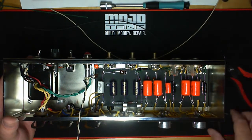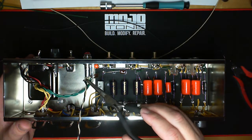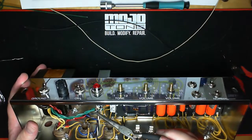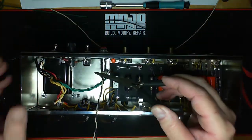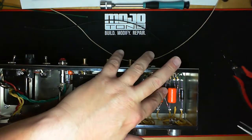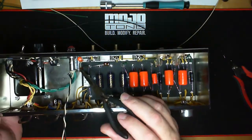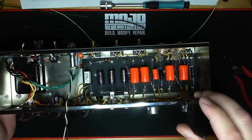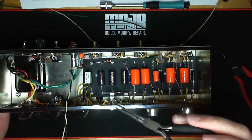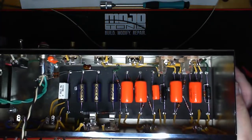We're back. I've got the 100 ohm resistors in place, and I went ahead and soldered the filament line to the first octal. One thing I want to point out: a lot of people assembling these kits sometimes swap the 100 ohm resistors for the 100k resistors that belong in the preamp section. The 100 ohm is brown-black-brown and the 100k is brown-black-yellow — you can just glance and see the yellow stripe. Make sure your 100ks are in the right spot.